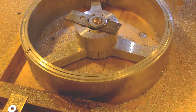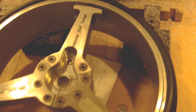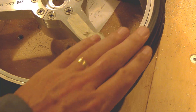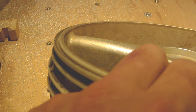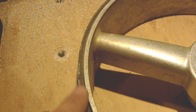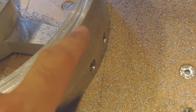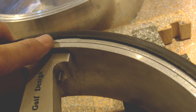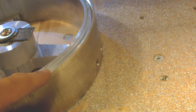The two grooves on the faces are made with a 3mm carbide end mill. On this wheel I put a tire to see how it fits — it fits okay, but I discovered that something is missing. I checked the previous wheel and close to the groove the height on the outside is a little bit lower. So we can machine the same thing and mill the outside of this groove on both sides to be sure that the tire is well mounted. You can see there is a small step, and this step will be removed with the external milling on this face.